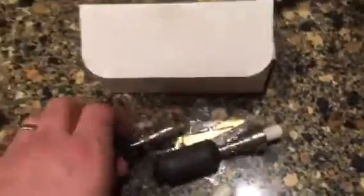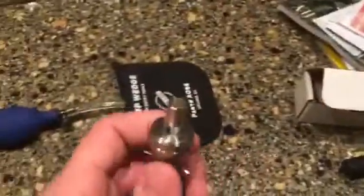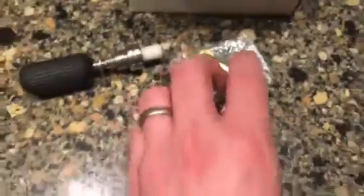These are for tubular locks, for vending machines, video arcade games, whatnot. The ones with the circular bike locks. So you use something like this to feel around and figure out where the pins are, and then you move these around, and that basically turns this into a key. This is from Southord, just as this practice lock is.